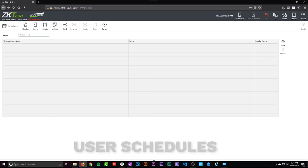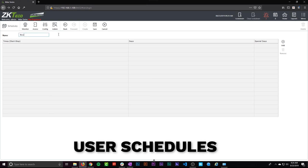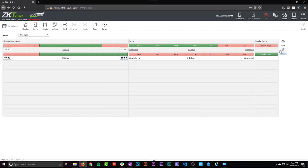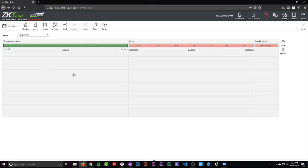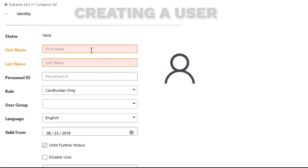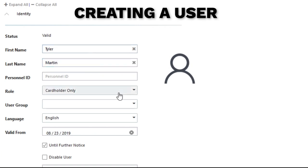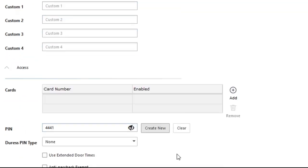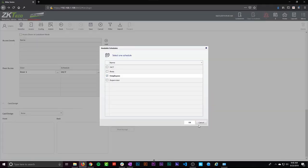Now let's create some user schedules. This is just like the door mode schedules, except that it grants or denies certain users access regardless of the current door mode. I'll set up three schedules: boss, supervisor, and employee. The boss will have access to all doors 24/7, 365, even if the door mode is inaccessible. The employee will have access only during business hours, Monday through Friday. The supervisor, like the employee, will only have access during business hours, but we'll give this person 24/7 access on days that the boss is out of town using a special day we set up earlier. Now let's set up a user — I'll use myself as an example. I'll fill out some basic information, add my profile to the design team user group, give myself a code based on my proximity card, and grant myself access to the tech room door on the employee user schedule. And that's it — we should be good to go.